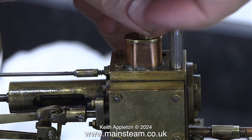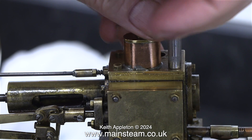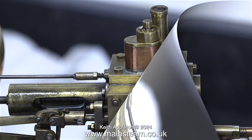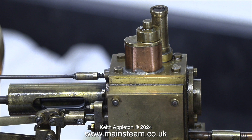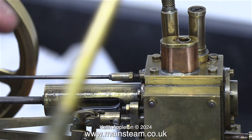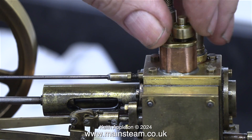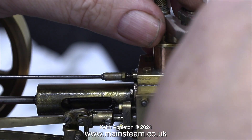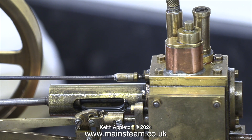If you don't have any nut spinners in your workshop I recommend you go out and buy some — they are really useful. That's the cover plate back in position. All I need to do now is fit the safety valves, one of which is modified to be an inlet for the compressed air. This filler cap is very fiddly — I think it should really have a screw slot in the top. Eventually I removed it, filled it with oil and replaced it, but there's no way of tightening it up other than using a pair of pliers, which I'm not happy about. The overall appearance of just about everything on this traction engine is pretty good, but it's unfortunate that a lot of the materials used are the wrong ones for the application, and throughout the job soft solder has been used — the boiler is really a bit of a disaster being soft soldered together.